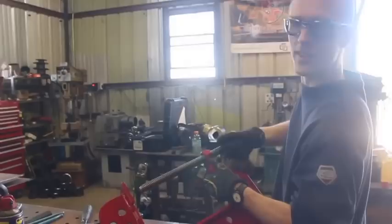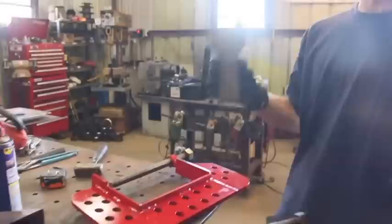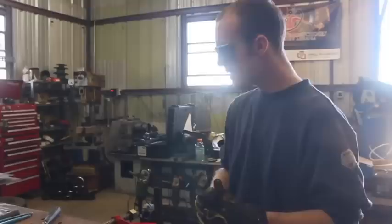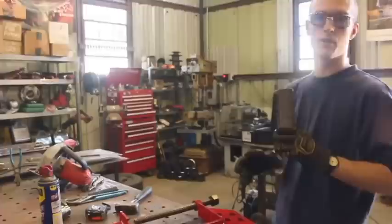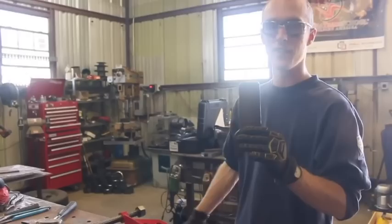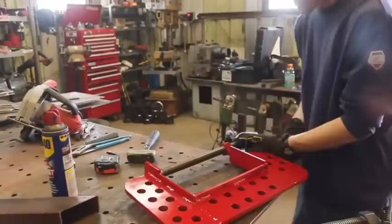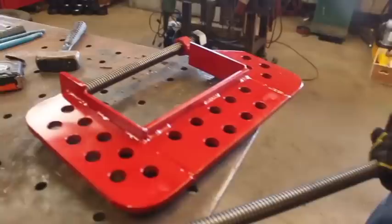The way these things are set up, if you're just going to move this screw in and out, it's really easy to do with your hand like this, and you can put light clamping pressure on things. However, if you need serious clamping pressure, there's this DIY homemade wrench which I put together — just cut this out on the plasma cam machine. Hypertherm made quick work of this half-inch plate. I chose this over a store-bought wrench partially because I don't know where to buy a 1-5/8 wrench — it's an odd size — and partially because this is short, which can be a very important feature.